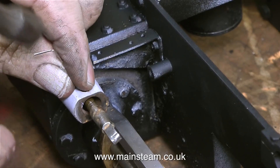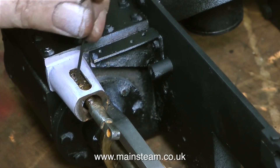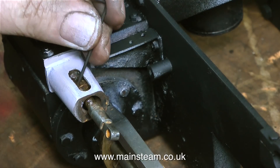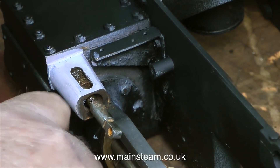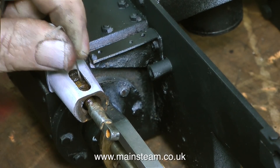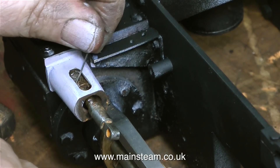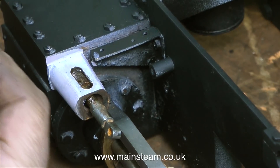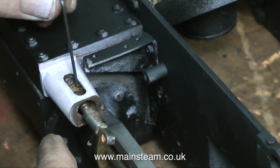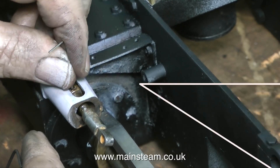In this clip, I'm tightening one of the valve glands that screws into the steam chest on one of the cylinders. As soon as I removed the running boards when I originally dismantled the engine, I noticed that one of these gland nuts was completely free to slide up and down the valve rod without actually doing its job as a gland nut. For those of you who are not familiar with gland nuts and glands, it's the way that you stop steam leaking out of the steam chest down the valve rod. A valve rod or piston rod goes through a gland, and what's normally inside a gland is either an O-ring on modern engines or graphite yarn on older ones, and the gland nut compresses the graphite yarn against the valve spindle or valve rod or piston rod and stops the steam from leaking out. This part of the video is condensed — this took ages. I would think it took me possibly three quarters of an hour to do this using two allen keys of different sizes. These allen keys fit in the small holes in the gland nut, and very slowly you can rotate it into the position you need it to be.